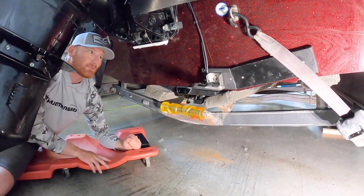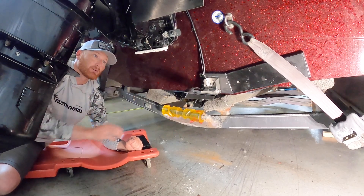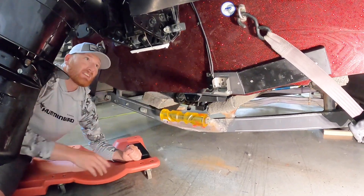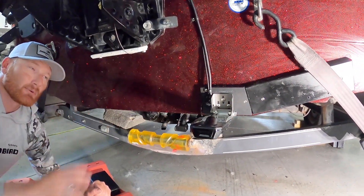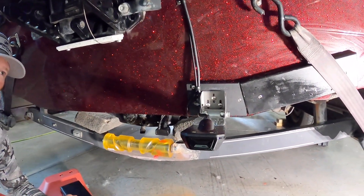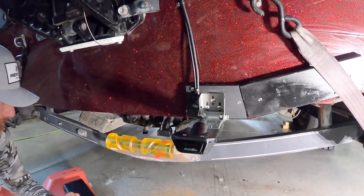Transducer boards — the more the merrier, that way you can move things around, get it dialed right in, and not drill into your boat. We put a few cable ties in, chamfered into the fiberglass so nothing is cracking, filled the holes with silicone, and ran the wires up — we'll show you how we clean it up when we get to the boat.